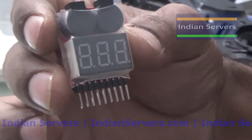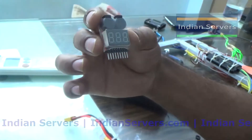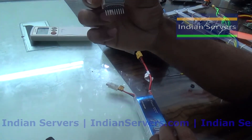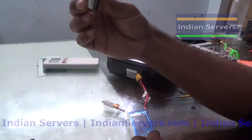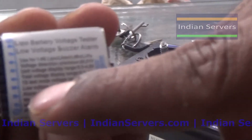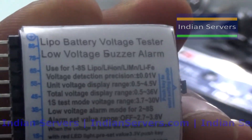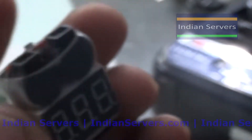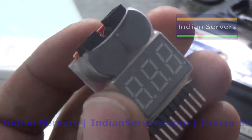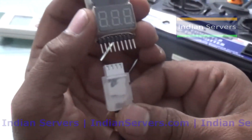Now I'm going to use a voltage checker. This is the voltage checker or battery tester. Using this tester we can find the overall voltage of the battery and also the individual cell voltage. This battery tester is compatible up to 8S LiPo — a battery with up to 8 cells. Here we are using a 3S LiPo. After connecting the battery you will get a red indicator with a buzzer, and it will automatically display the overall voltage and individual cell voltages one by one.